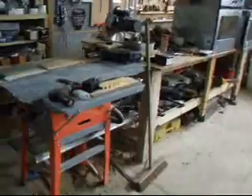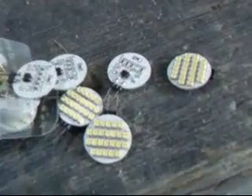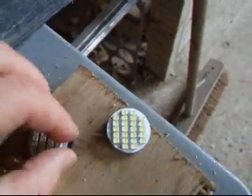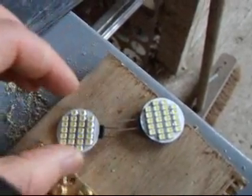These lights have been very successful. Some of these are corncob LED bulbs, but others are made up of small LED disks. They're 12 volts each, and one can simply wire a couple together so that you've got a central pin into a strip connector, and the two pins on either side put these in series to do 24 volts. Above the workbench, that LED light is actually rather effective, so I've been using more of these rather than the corncob lights.